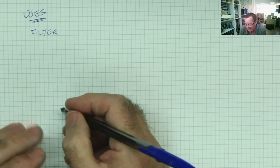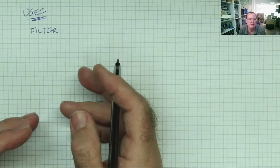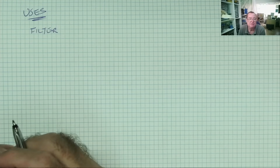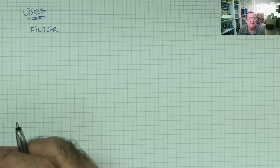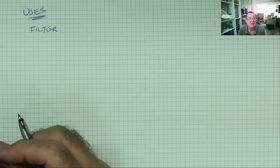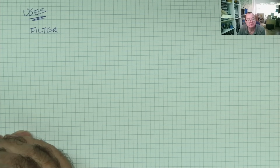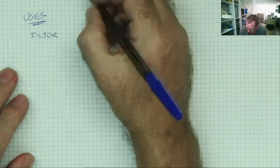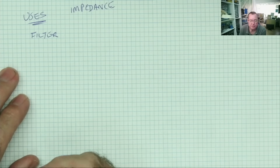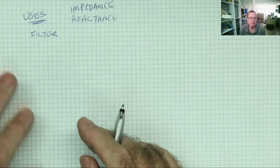This takes advantage of the fact that it will pass DC and block AC. And just like capacitors, depending on the value of the inductor and the frequency of the AC, it will respond in different amounts. Its resistance to AC increases with the frequency of the AC, whereas with capacitors, the resistance to AC decreases with the frequency. So, opposites again. Because the resistance varies with frequency, we don't call it resistance, we call it impedance. There's another related term called reactance, and we'll talk about the difference between these in the next video, and we'll do a few more experiments.